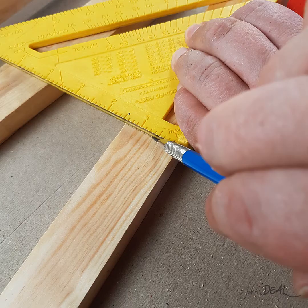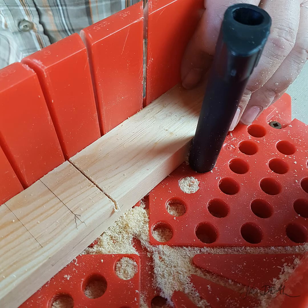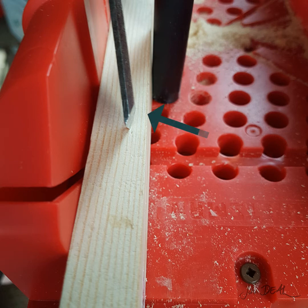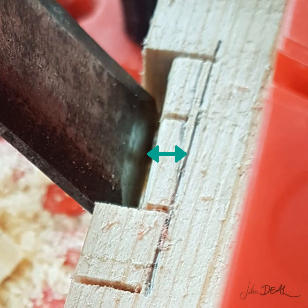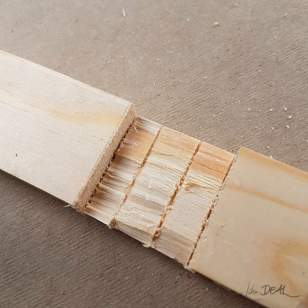Clamp your brace in the miter box with the first mark lined up to the 90 degree guide. Try to get as close to the inside of the line as possible. Cut halfway down. Move down a bit towards your next notch and cut. Repeat if needed. Cut your final notch on the inside or right on the line. The more accurate your cuts on these ends, the more snug your lap joint will fit. The direction of the cut follows the angle of the beveled edge. To get straight down action from this chisel, place the beveled side against the wood and angle the chisel away so the bevel becomes perpendicular to the material. It's better to be a bit conservative here and start back from the base of the lap joint. Take your time and chisel away until you are halfway into the wood. A sharp chisel will be more accurate and make a cleaner cut.